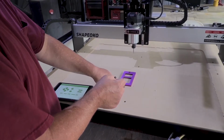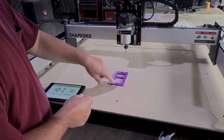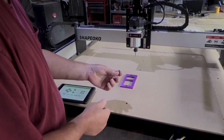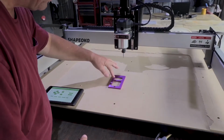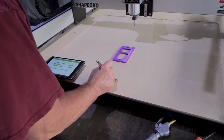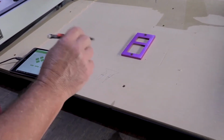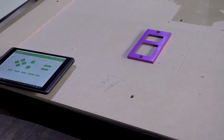I just wanted to show you, in case you didn't know or figure out, we need a tapered screw, or at least in my case, because the taper has to line up the center of the hole, because the hole's bigger than the screw. The taper needs to align it evenly so we're straight. You guys probably figure this out, I'm probably just wasting my breath here. The taper will make it even all the way around, and that's what we're looking for. That's why you need to use a tapered screw. Don't use a flathead screw if your screw is smaller than the hole.